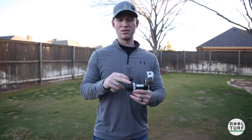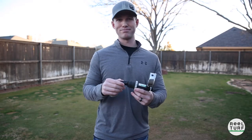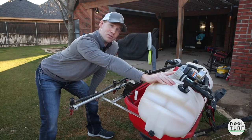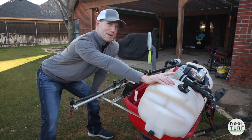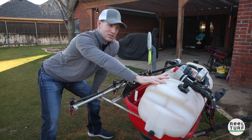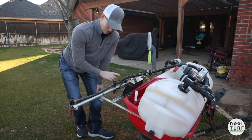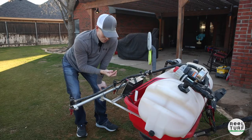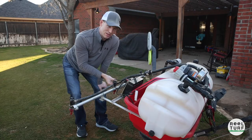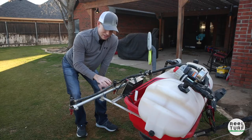If you replace that, it should resolve any issue you have with the back pressure valve holding pressure. Now, we've proven the pump is good and the back pressure valve is good and the o-ring is still good. So what's happening? I think since I have full pressure happening in my system like it should, that means I've got a problem on the output side. Checking my hoses, I did find some white buildup down here on this tee — I've got some kind of slow leak happening here, and that's allowing pressure to escape and not keep an even pressure against my tips.